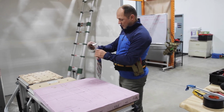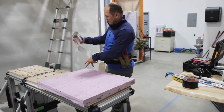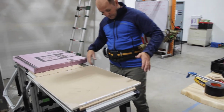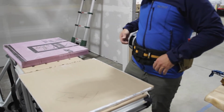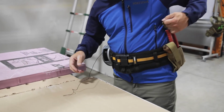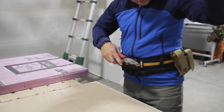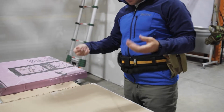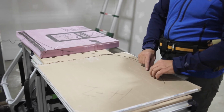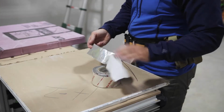The method I prefer, just because I'm more comfortable and I know it'll never come off, is I use wire. So I've got this little belt on. Again, this is top, bottom, whatever. What I do, this is tie wire. You use this primarily for rebar, things like that. Tie rebar together. So what I would do, I wouldn't cut this, set it backwards. Same principle. I take this, I staple this down.